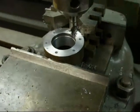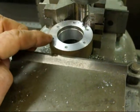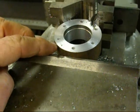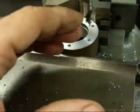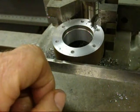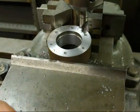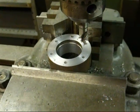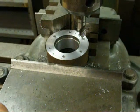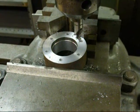In the world of model making there's often a need for bolt circles. Now this part is ready to take out of the milling machine — those center-drilled holes aren't going to move, so I can just take it to the drill press and drill them out to their final size. Let the drill float a little to find its center; do not clamp the part down. Keep a good hold of the vise though — but don't drill into the vise. It really bugs me when people drill into a good vise. Be sure to watch my many other videos. This is Tubal Cain saying thanks for watching and so long for now.